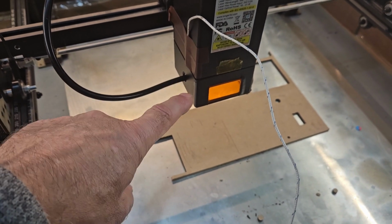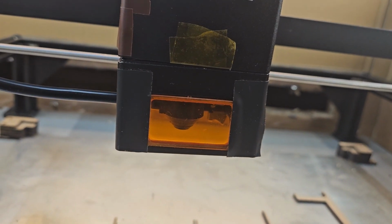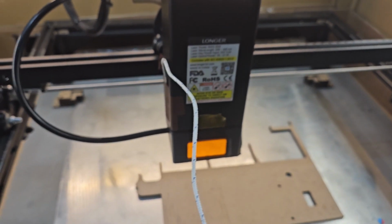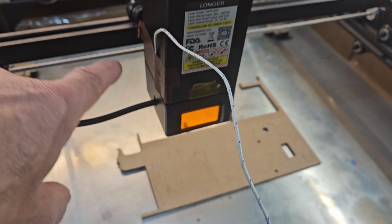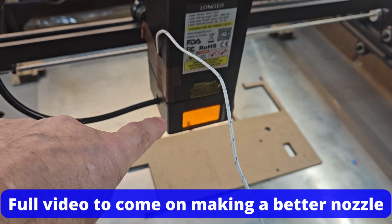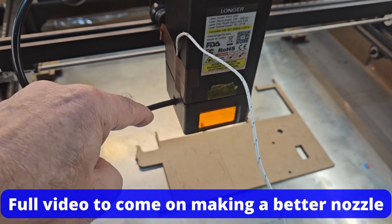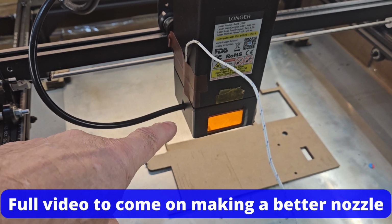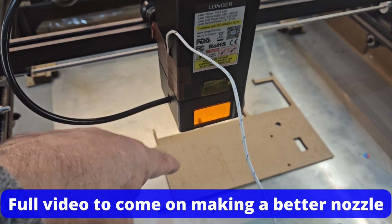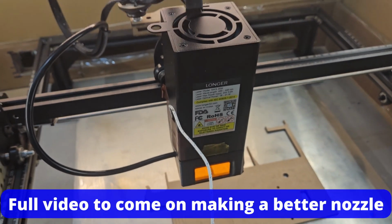I've also got a different nozzle. In full disclosure, I've got a 3D printed nozzle on there, which allows me to have 4mm tube going directly into it. I'm running it during this test because I just want to make sure the laser beam is not clipping any part of the plastic. If it does, it will just melt the plastic. So that's why it's in this test. Again, it will have no effect on the temperature that the laser reaches.